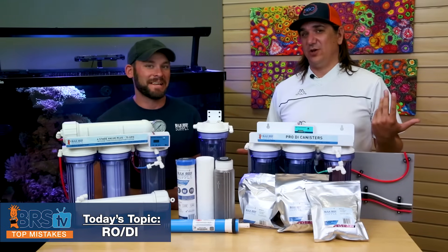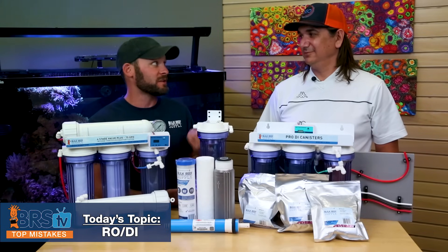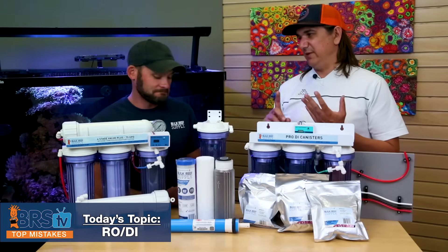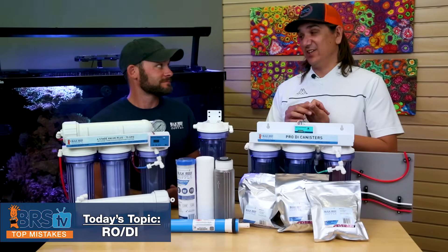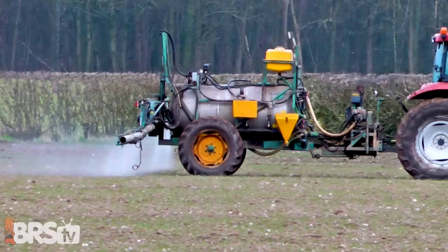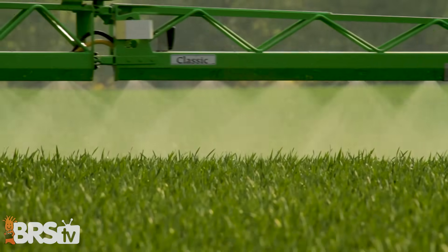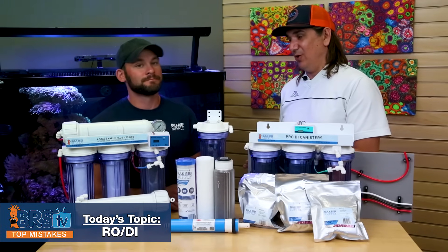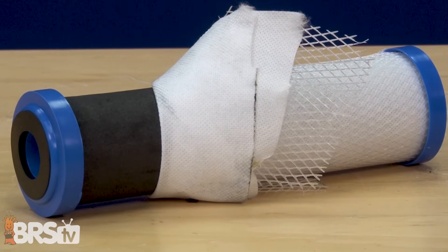Number four is something I've gotten a lot of phone calls about over the years. The mistake is assuming that your well water is better or less contaminated than city water. Barring some disinfectants, it could actually be worse. You just never know — it could have arsenic, copper, any metal from the ground, phosphate, nitrate, silica, herbicides, and pesticides from farm runoff. Whatever's in your area can be in the groundwater. And yes, you still need carbon blocks on well water, because those herbicides, pesticides, and other contaminants need to be removed too.